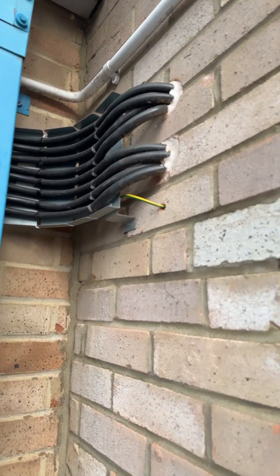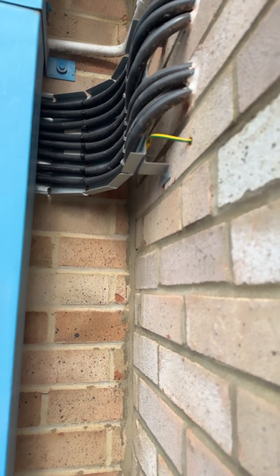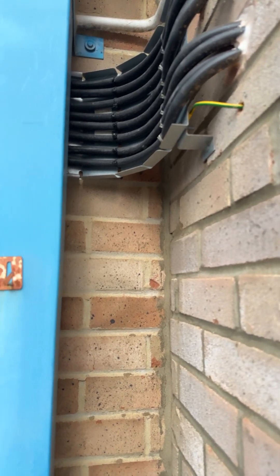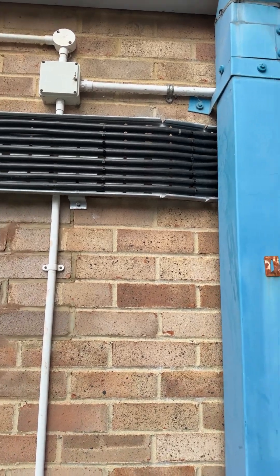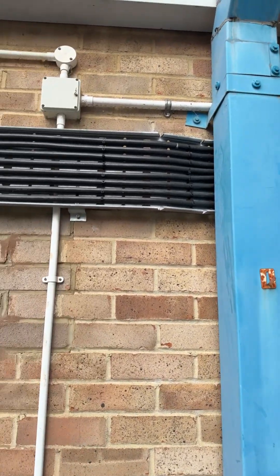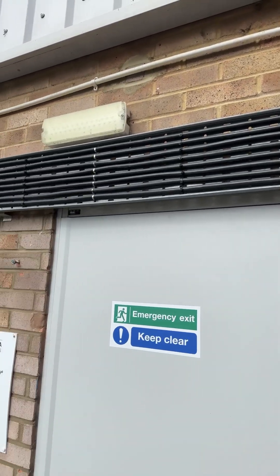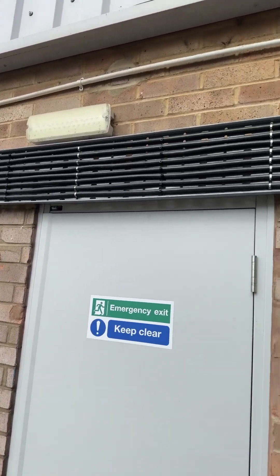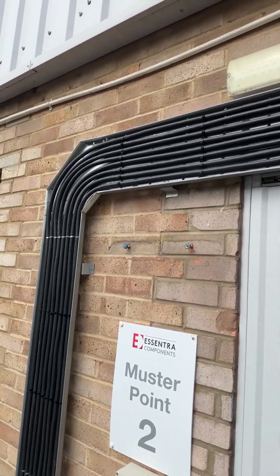Great to see the fire seal and the fire block's been put in. You've also got a nice bit of earthing, a bit of bonding there. And the cables are really nicely dressed in — you can see that straight away. They took a bit of time and consideration with that. You've got your metal tie wraps, your plastic tie wraps, all very evenly done. Absolutely lovely job. A bit of cable OCD — it's what we like in the industry.